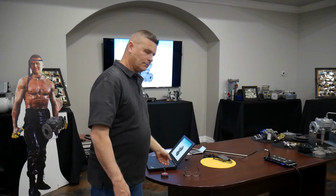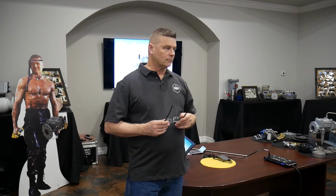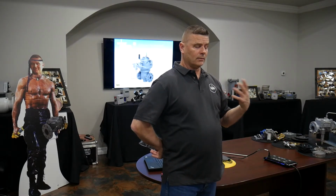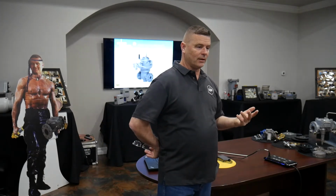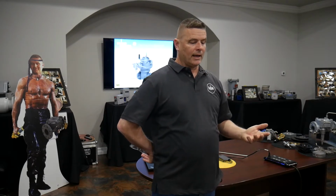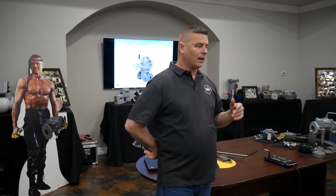We've actually had to go change out flow grids and put Flowmaxes in because of that reason, because of the supply pressure drop in cold temperatures. It was a big problem solver for Mexico gas on the eastern side of Mexico. We've had to swap them out before because of that reason. And think about the world where we're speccing F70 PRs and low pressure, where they're trying to control at low pressure and also trying to relieve at low pressure, and the flow grid's out of the game. You can't set a flow grid, as an example, as a relief if they want to set less than 20 pounds, because you don't have the differential pressure to make sure it'll stay locked up.